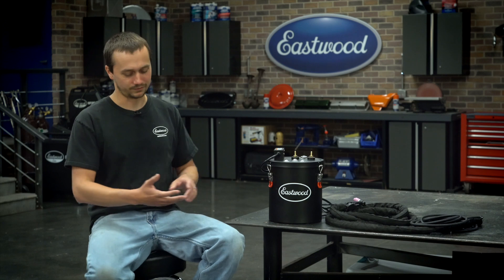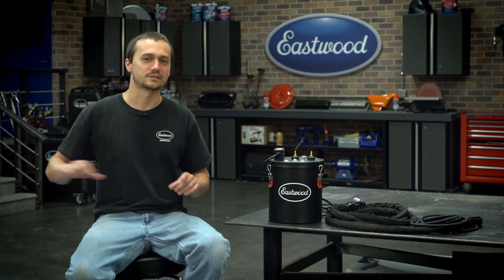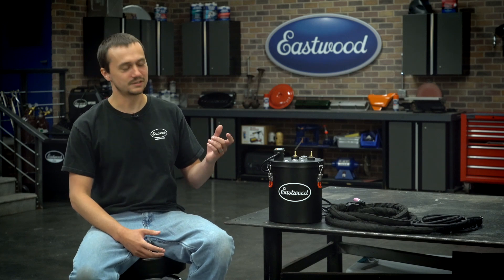So who really needs this? Well, if you've ever found your TIG torch just gets too hot in your glove and you've got to stop your weld and come back and start again, this is perfect for you. This is perfect for guys welding thick aluminum or thick steel doing long welds — say over two feet. We were able to weld eight feet consistently with this machine on quarter-inch aluminum, and the torch was still easy to hold, still very comfortable, and you still got a precise weld.